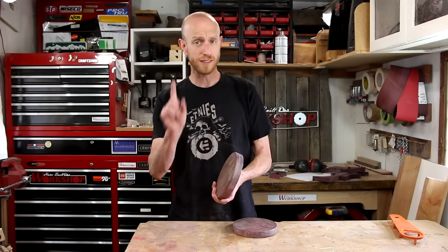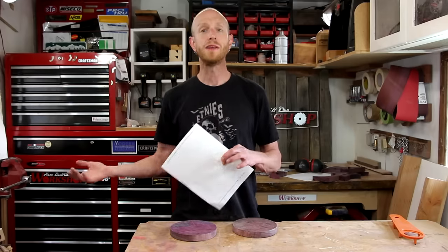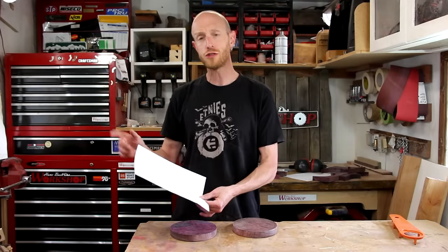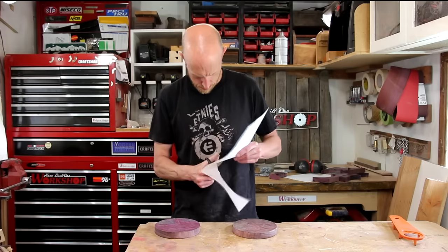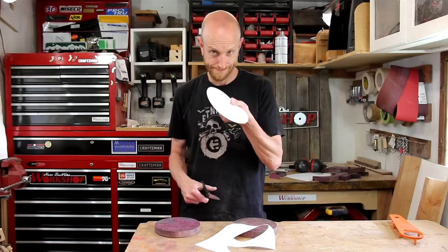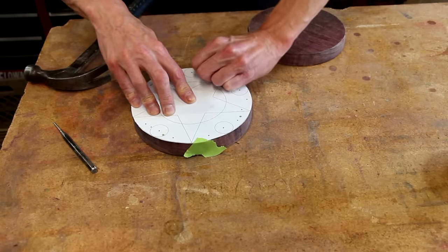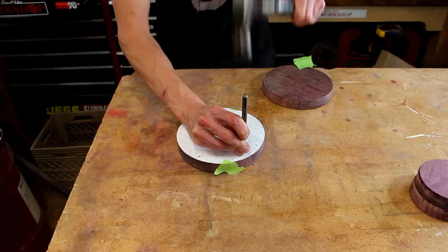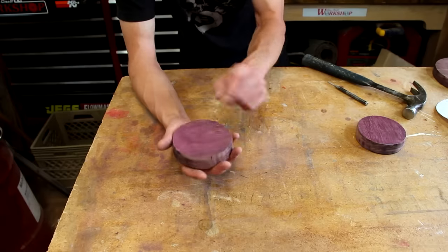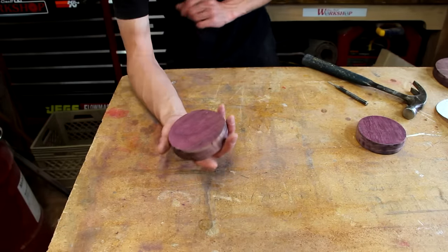So I'm going to stop that process and get these holes drilled, then I'll finish rounding everything off. On the template that I downloaded from Lee Hite's website, it has all the locations for the mounting hardware. I'm going to cut this out to make it a little bit easier to line everything up, then secure the template to my disc with a couple pieces of tape. I'll use a punch to start marking out the holes, and since I have a tiny mark from the compass, I'll center punch based off of that mark.